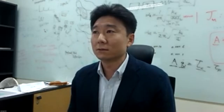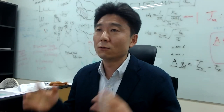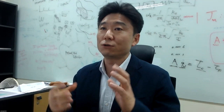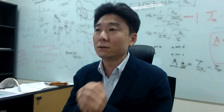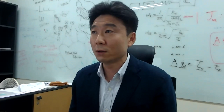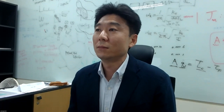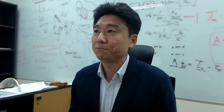Yes. For the first humanoid robot, the position control humanoid robot, we use the Dynamixel Pro from the company Robotis, which is quite a popular modular actuator. It has the motor, gear, and driver combined together as one. And in the second robot, the Dokkaebi, we are using Kollmorgen motors, Elmo drivers, and harmonic drives. So these are off-the-shelf actuators. And as I mentioned, they are very different, but the algorithms worked fine for both. So we are happy about that. Okay, thank you.